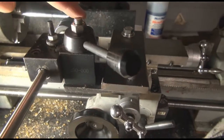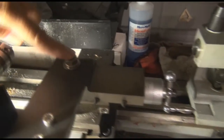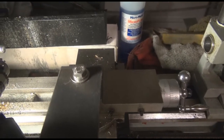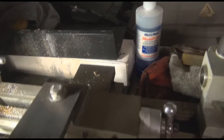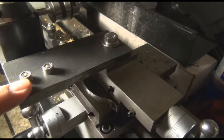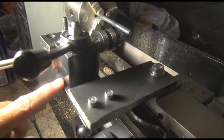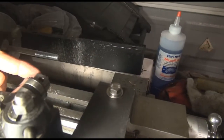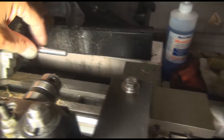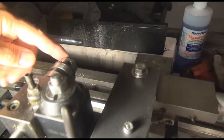The normal quick change part of the tool post actually goes right here on the cross slide and compound. What I did is I took that off. I had a little bit of about quarter inch steel sitting around in scrap, so I cut this down and put another thinner piece — it's probably like 3/16ths or so — off to the side. This gives me a little bit of clearance because otherwise the holder is too close to the working stock right here. This is just purely an example and I was centering the drill this way on it.